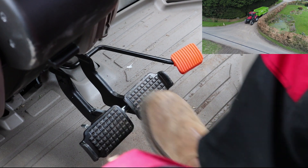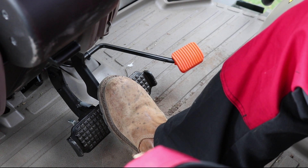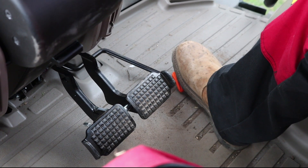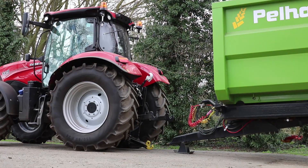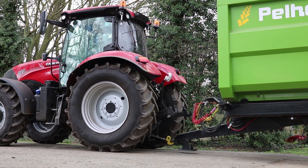When I want to bring the tractor to a stop I can just put my foot on the brake, no need for the clutch, and we'll come to a standstill. When I want to move off again I just release the brake pedal and accelerate away. If I'm backing up to an implement or on a loader and want to use inching control, I can slightly release or feather the brake pedal until I inch forward, giving more precise control over movement when backing up to implements, trailers or using it on a loader.